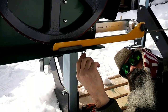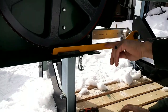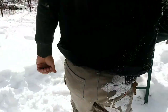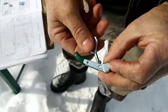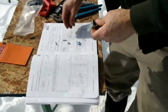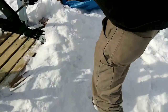Well, these are adjustable, folks, and you're gonna have to adjust them to where they need to be, and then there's a jam nut on there to lock them in place. I'll show you on the one I got out already. Okay, so you spin these in or out, no matter what adjustment you need. And then you can tighten down the jam nut so it saves your adjustment. So that's how those work. And then just two screws into that threaded block under the guard.